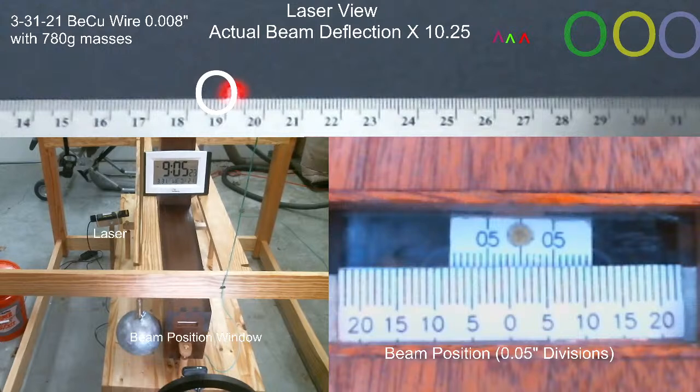For this particular arrangement, going from neutral to just one direction like that, the deflection is going to be around 35 millimeters total on the laser. But what's going to happen is this thing is going to accelerate, and you see it's moved already. It's going to begin to accelerate, and it will overshoot that 35 millimeter point. It was sitting at around 190 millimeters, so it's going to overshoot 225 by a considerable amount. I'm thinking more like 260.